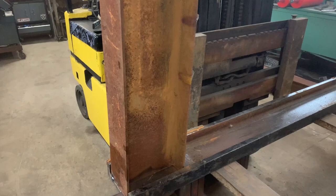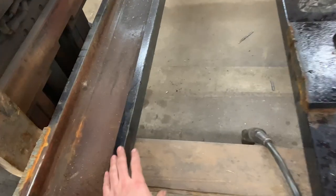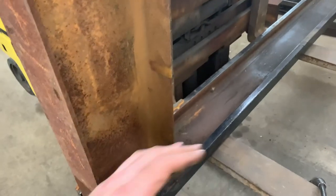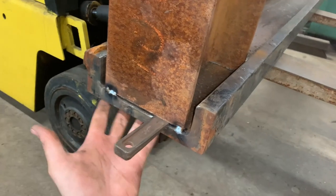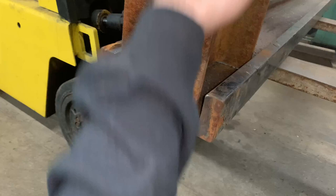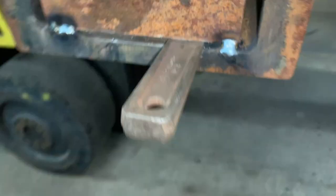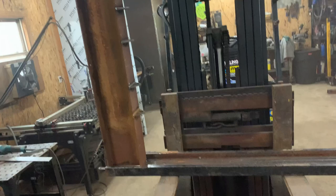That's essentially it there. What I actually didn't realize is that inside the C-channel there's a lip right here, but not on this side. It's kind of hard to level on the forklift — you could sit there in the cockpit for half an hour trying to get it level — but that wasn't really the right way to go. So what I did was I knew that this edge here was very flat, so I just took the two-foot square, came up and leveled it that way. It seemed to work out okay. There was a lip right here but not over here that I didn't catch in time, so I took my wedge and drove it in until it was square with the two-foot level. I think that's going to be good enough, but I'm going to tack it a bit more.